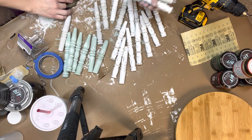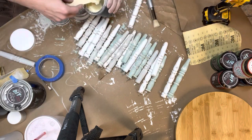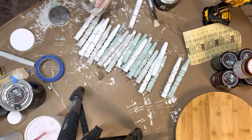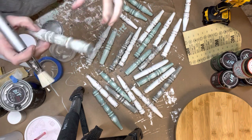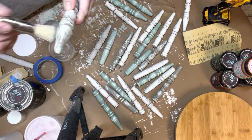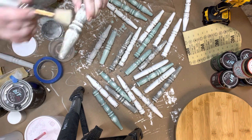All done — and now it's time for waxing. I scoop out some of my DIY clear wax into a separate container so I don't contaminate the unused portion. I've got a JRV 1-inch stencil brush. I'm using this because it's easier for the wax to get into the smaller nooks and crannies when you're using a smaller brush.